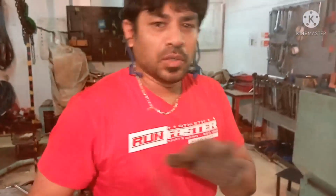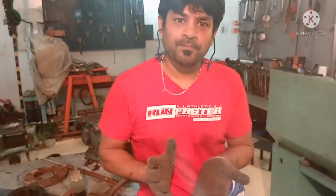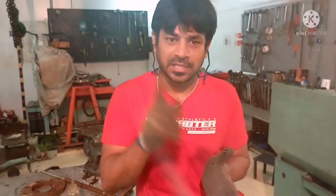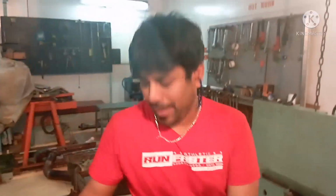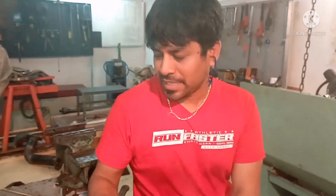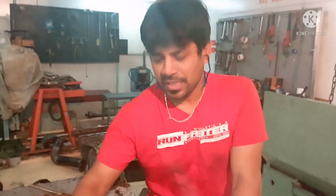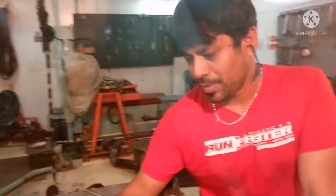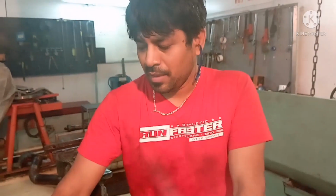Okay. So this is how we have to dismantle the puncture valve, and these are all the checks that we need to do. We have to check the threads, the mating surface, the spring, and the cylinder liner. All those things you have to check and work back. I will show you later how to test this puncture valve. So now I think it should be okay, and you have got some idea about how to dismantle and assemble the puncture valve.